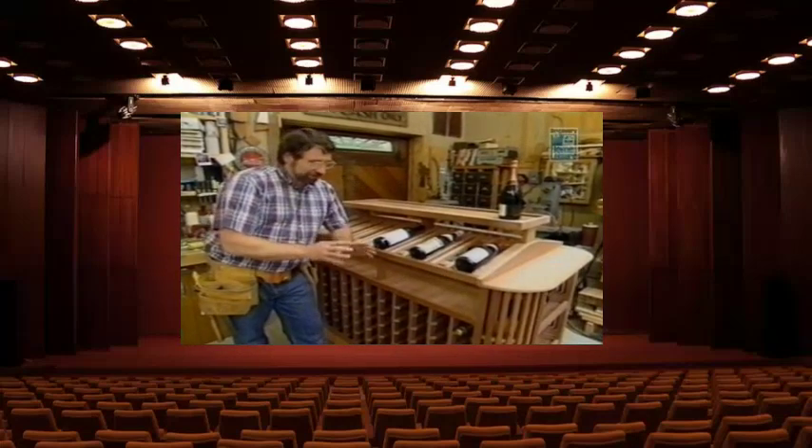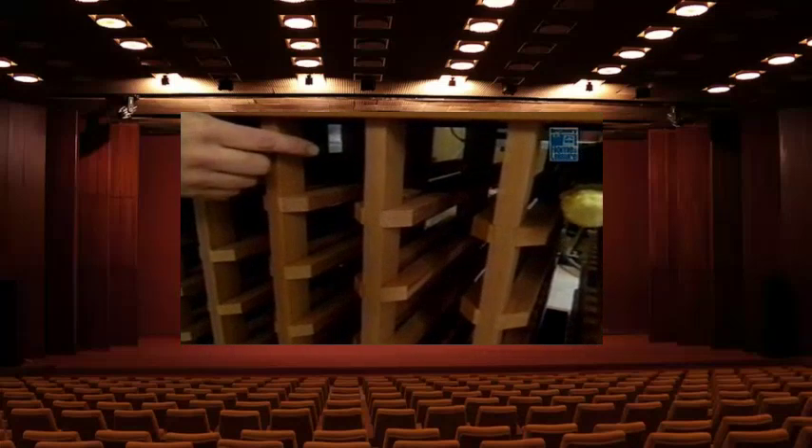I built ours out of redwood and it's really a lot of small slats and pieces of wood. To start building the storage system, there's a one-by-two on each side and a one-by-four down the middle. It gets notched out to receive the cleats that support the bottles.